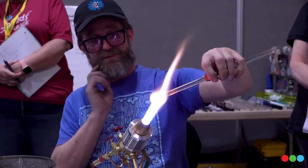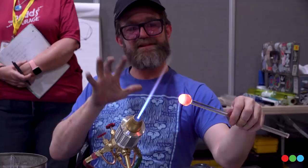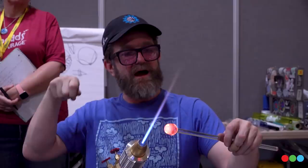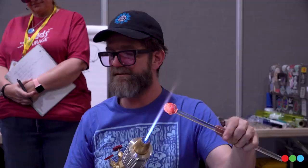If I just keep heating this, you pretty much can get the marble to round out. We'll let this cool down. I wouldn't want to add the backing on a marble this hot — you have to think about what you're applying things to. When you're applying glass, whatever you're applying needs to be hot, and usually what you're attaching it to needs to be somewhat firm enough to receive it and act as a point of resistance so that you can give it a good connection.